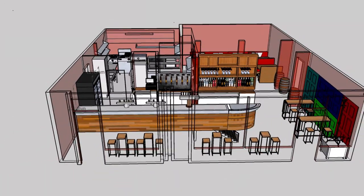So today we're going to start to concept out a little bit of that seating, and there's going to be a lot of plywood cuts involved in this build. We need to make about 12 of those benches. So in order to get a little bit of repeatability and not have to struggle with a full sheet on the table saw here, which is always very tricky, I've decided today we're going to build a Tracksaw rail for the circular saws that I've got, and then hopefully we'll have time after that to start proving the concept of these first benches.